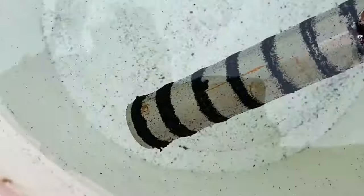So you can see how this method works really well. We flushed out all that dirt in the bottom, then turned the radiator over so that any dirt at the top and any air in there got washed out — I didn't even have to bleed the radiator. Obviously with a big double panel it's a lot harder to move around, but it's still the same thing: put it on, wash it through, and by pressurizing and un-pressurizing it you get a nice whoosh of water through it. Banging it just releases any dirt that's stuck to the sides before it breaks off when the radiator gets hot and expands. This method works really well and that's the method I use. I do hope my video has helped you. If you want to know how to remove your radiator, you can click the link to see my video on how to remove a radiator for decorating. Don't forget to click subscribe, click like, share me with your friends, and a really big thank you to everyone who's left a donation to my toolbox fund. Bye for now and I'll see you next time.